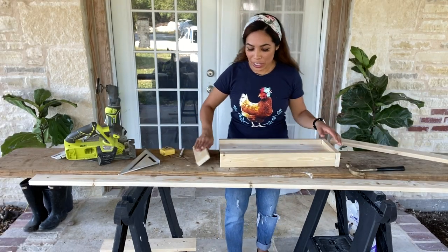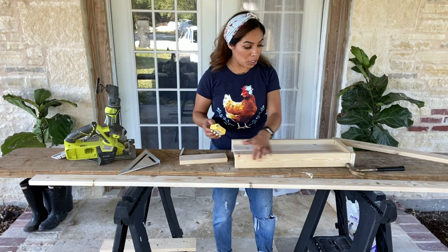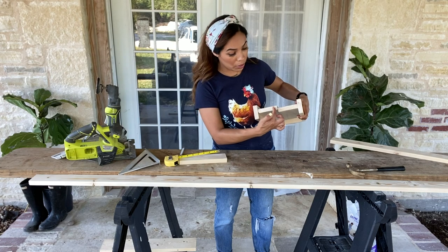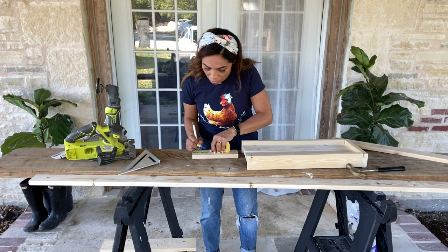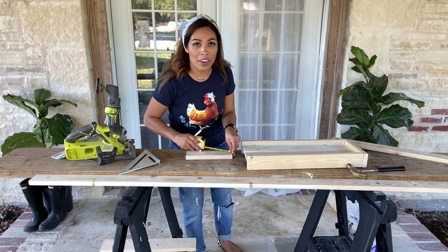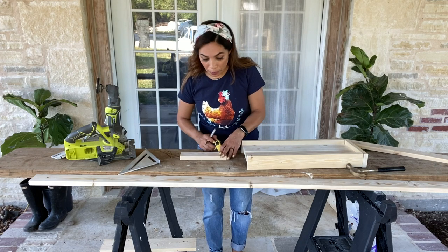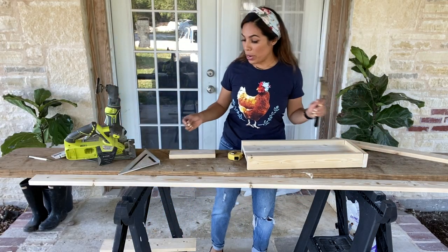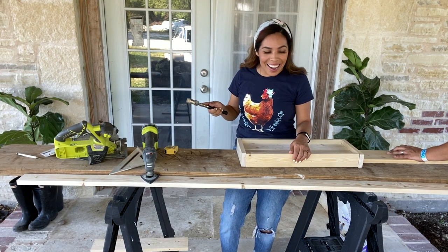It's coming along just great. I've already hammered the top side piece. You want to make sure you measure out on the side where you're going to be putting your nails, just like we did with the side part. You want to make sure you have a nail on each of these sides and at least two nails on each board. The first measurement to hit the nail right on the side is going to be three-eighths, then one and a half, and three and a half. You're going to do that starting from each end toward the middle, and each nail needs to hit at the right spot — that measurement is one and a quarter. The little X's are where my nails are going in. One of the things I found easiest is to pre-nail everything, not all the way of course.